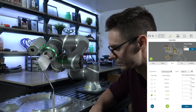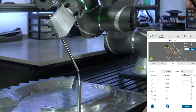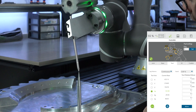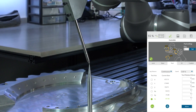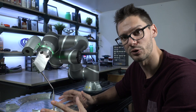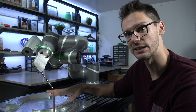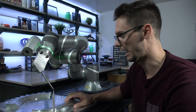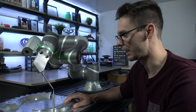Can you rotate around? As you can see, the TCP is pretty static with respect to our reference — nothing moves except the orientation. This is honestly a very good sign. With a great TCP calibration like this, you'll be able to do great probing to define where this part is with respect to the robot base inside RoboDK. And this is the key to having a precise robot path afterwards. Thanks for watching — I hope it helps, and I'll see you in the next video.